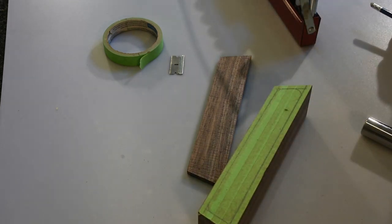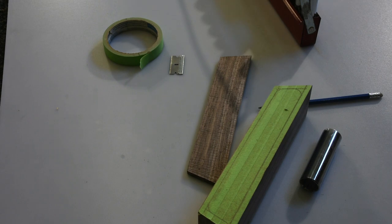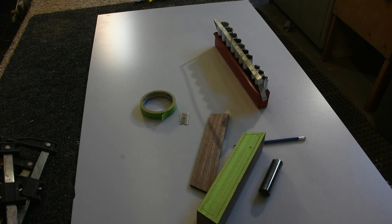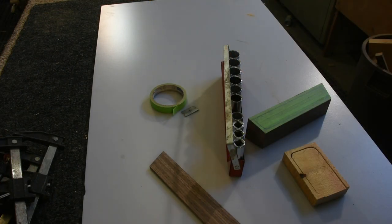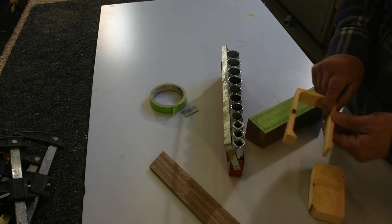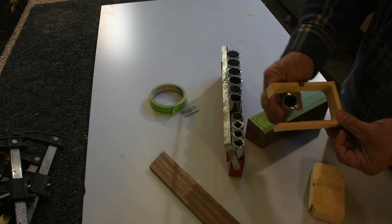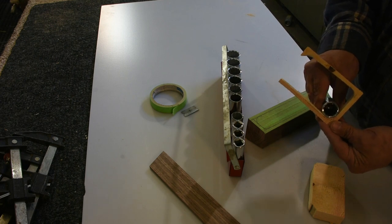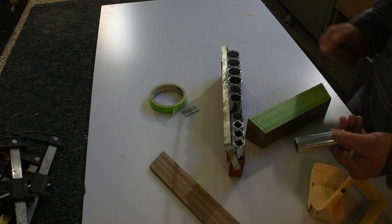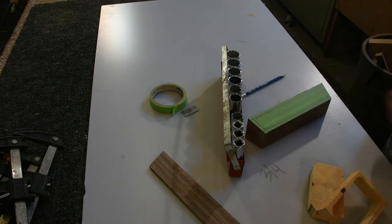I'll come in with a straight cut from the very end — you can see the pencil line. I'm just showing you the socket I was using; it's great for a small radius — a good shop hint. Here's my sample piece: I took a piece of stock wood, ran a quarter-inch mark all the way around, went to the bandsaw and let it cut where there was minimal blade tension. Then I measured with the socket — and it fits perfectly in the corner done freehand. That was a three-quarter-inch socket and it works great.